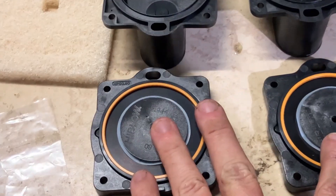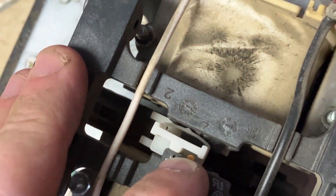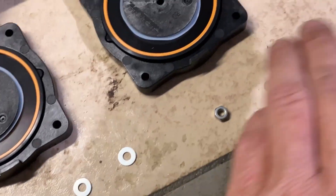Here's a new kit — that's your two diaphragms, here's your check valve, this is the filter, and this is the brake screw that cuts the unit off. This unit here has the micro switch, so all you do is move this white piece back over it — it engages the switch and it'll be ready to go. You might have to put a screw in it, but that's not needed here. It comes with new bolts.